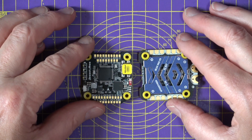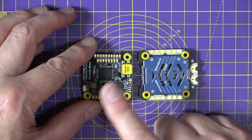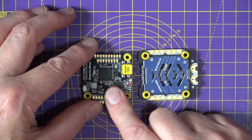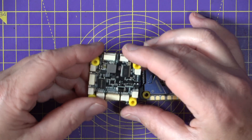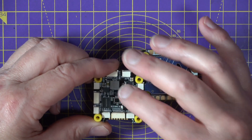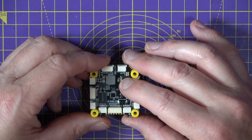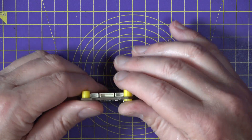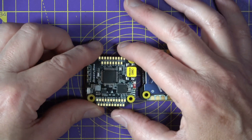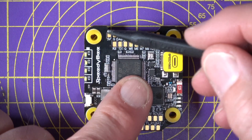It's a standard 30x30 mounting pattern, same as the original V2 stack, but they've beefed up the wireless comms so you can flash the flight controller firmware and download your blackbox logs 33% faster. They've added JST-style connectors for DJI and Caddx receiver, camera, VTX, GPS, and LED strips — no soldering needed on this PCB if you don't want to, although all connections are duplicated on top of the board if you prefer to solder.